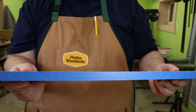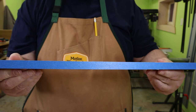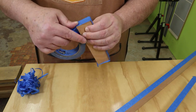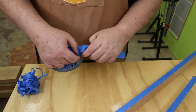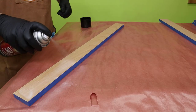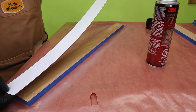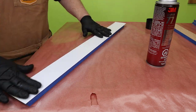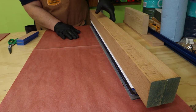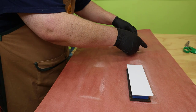When I glue the laminate on the fences, I don't want any glue overspray on the edges, so I'm going to cover the edges with painter's tape and trim the excess off flush. A razor blade knife can trim the tape flush to the edge. There's more 3M Super 77 going down — I'll let that tack up for a couple of minutes and then get the laminate down and do some J rolling. Here are the slider parts getting laminated and I'll put a little weight on them as well until they're dry.